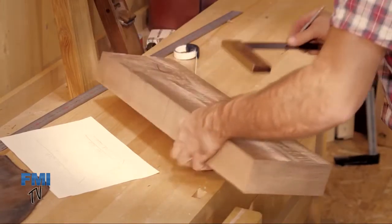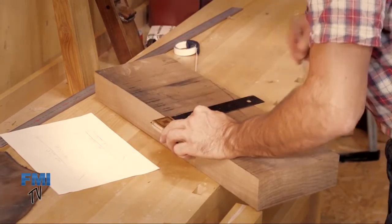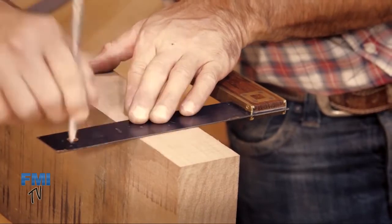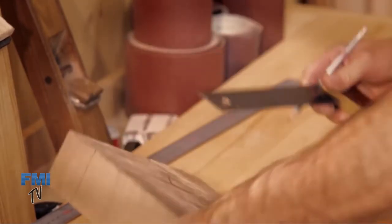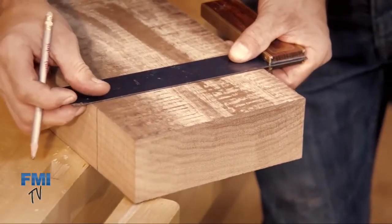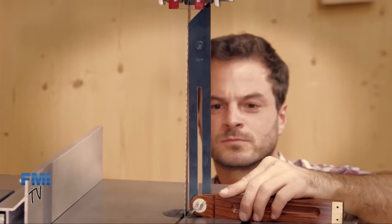The middle will be sketched around the outside. The four measurements that have been taken can be halved and entered on the left and right hand side. The endpoints are then joined on both sides. Using a bevel, you can calculate the cutting angle and set it correspondingly on the saw table.